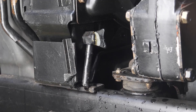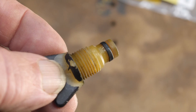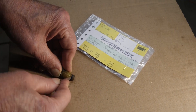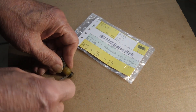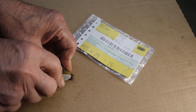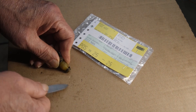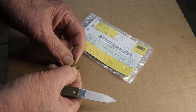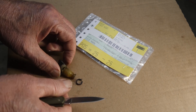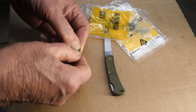Here's an example. This little O-ring here has gotten pretty hard and flat — it must be replaced. This radiator was repaired; it had a leak, and when it came back, I had no reason to be putting water in it. But as I was preparing the tractor, I put some water in before adding antifreeze, just to see if there were any leaks, and then it started leaking. So I put in an order to John Deere for some more O-rings.